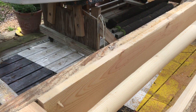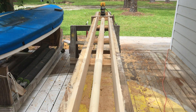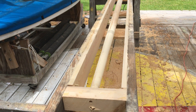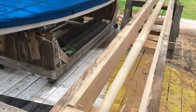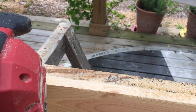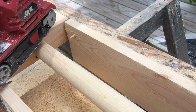So we end up with this: started off as a four-sided blank, went to eight-sided, put it on the sled, and started knocking off the big chunks. Got it mostly round, then we came in gently with our belt sander and just lightly pressed on the edge to work our way down.